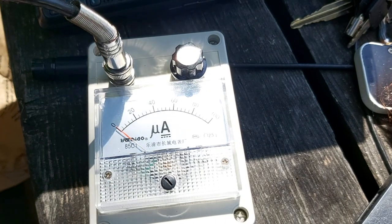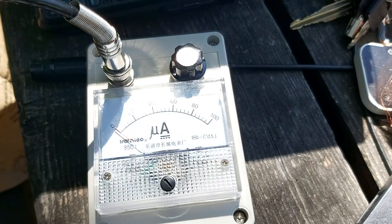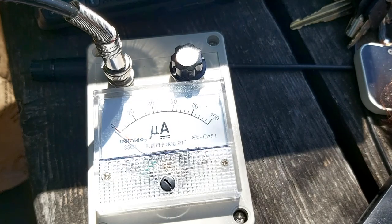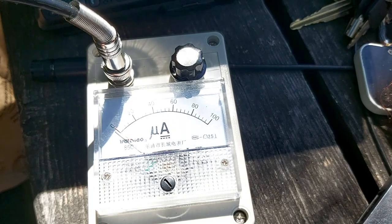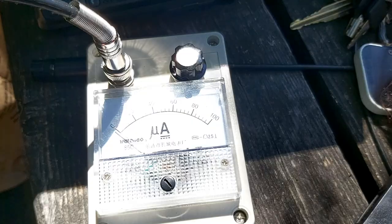All right, so now I have the 16:1 with the 43 material. Let's try that. Foxtrot four Whiskey Bravo Yankee tester. Needle is barely moving, so that one loses. 49:1 wins. I was expecting the 49:1 transformer to win, I have to say. I'm surprised. Well, you know, I'm sure the 16:1 works also, but I just want to find one transformer that works for me, and 49:1 works.